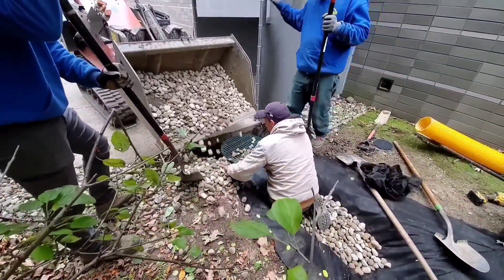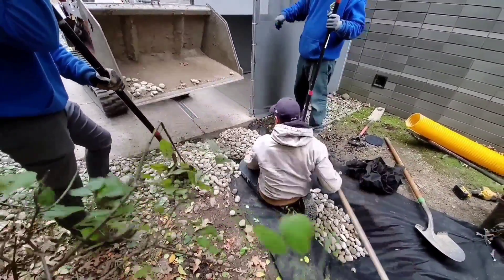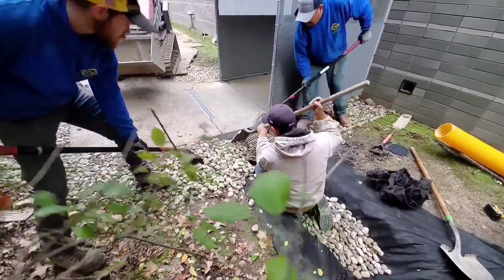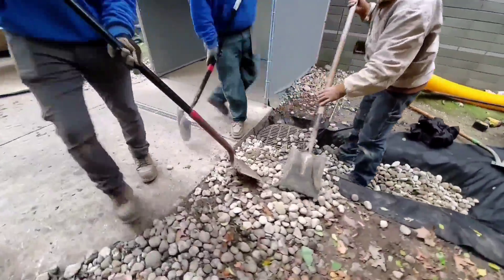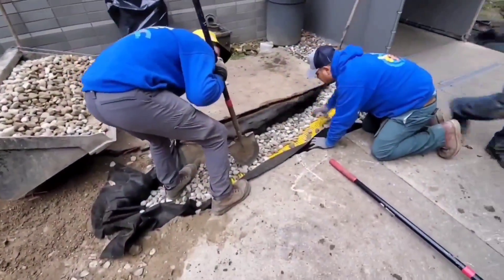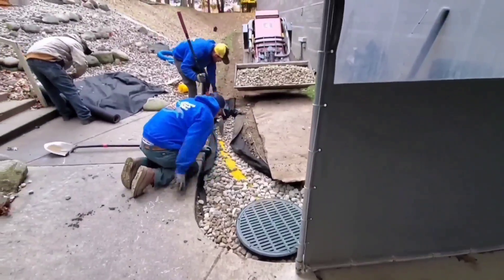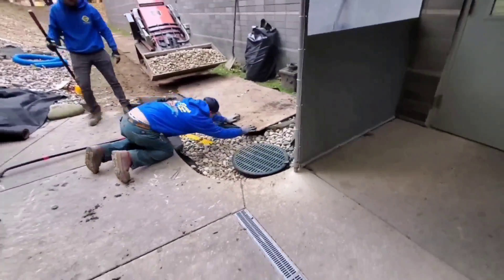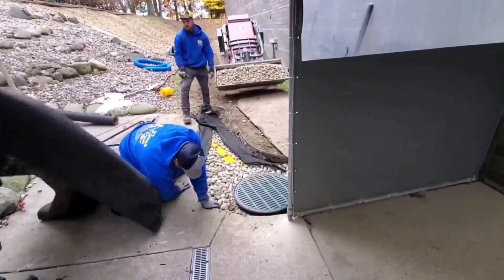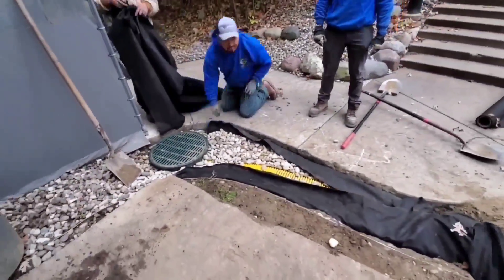We wanted to use an open French drain — we did not want to grow grass over this, did not want landscape on top of it. We do wrap it and wrap the top, which I'll show you. When we have basins in place to grab up all the bulk, sheet, and surface water, I want the open French drain because it takes in water faster than any other French drain. I want stone on top because water goes right through the voids of stone uninterrupted.